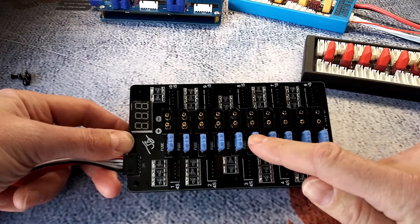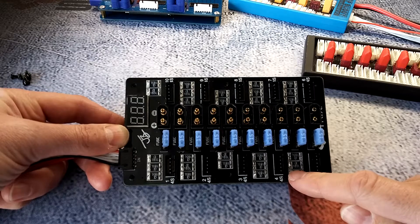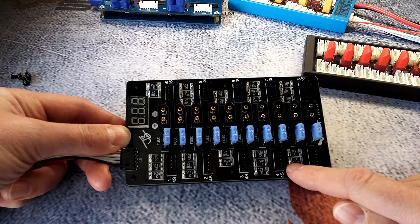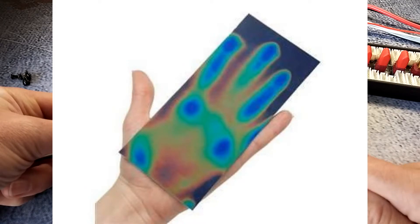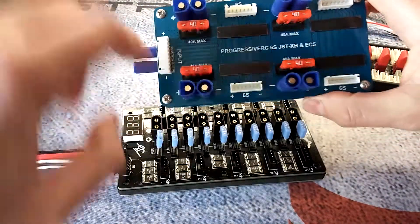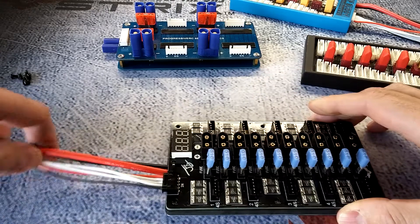The Joshua Bardwell version 2 Strix board has fuses on both the main discharge leads and resettable poly fuses. I've seen guys already complain on his video that there's no real way to tell if these are tripped or not besides feeling for heat. There's thermal tape and thermal LCD stuff you can get — double-sided sticky tape with thermal LCD you can stick to these if that's really your issue, kind of like this board here which changes colors if one of the fuses trips.